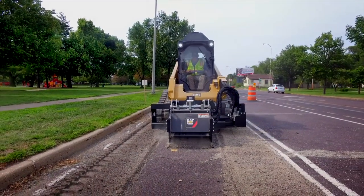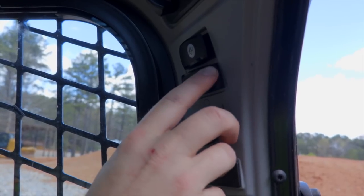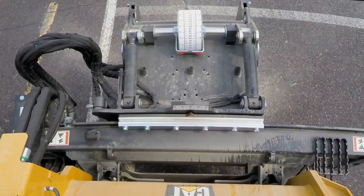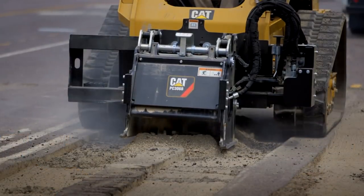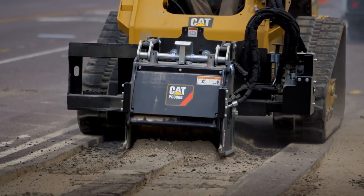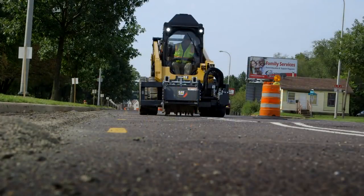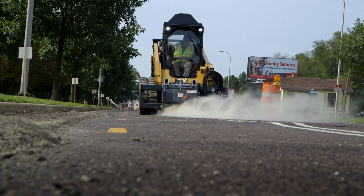Now we're going to talk about setting up the PC-306B. I'm going to raise it up and release the parking brake. The PC-306B has two independent shoes. They're self-leveling, so it does not matter what position the tool is in when you make what we call a plunge cut, because the shoes will come down, self-level, and give full contact to the ground. It's very important to keep the shoes in full contact with the ground or asphalt to allow for a good cut.